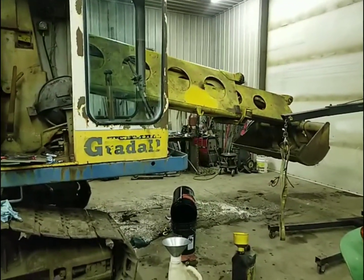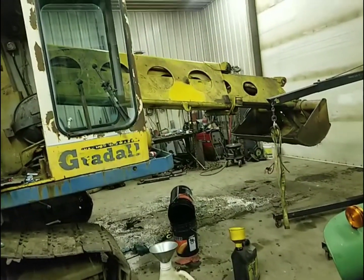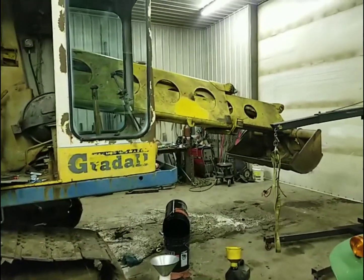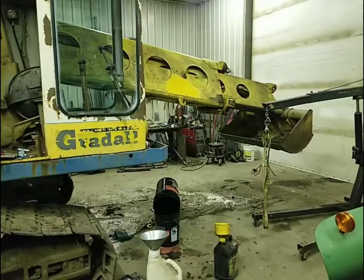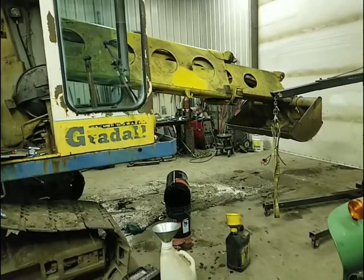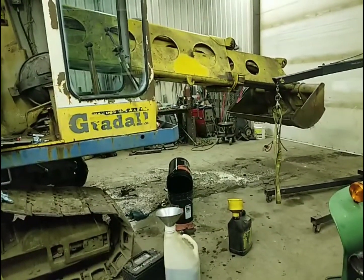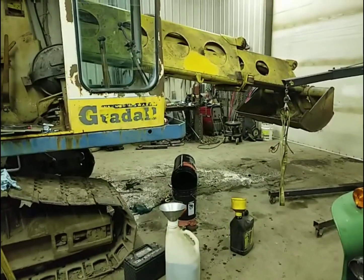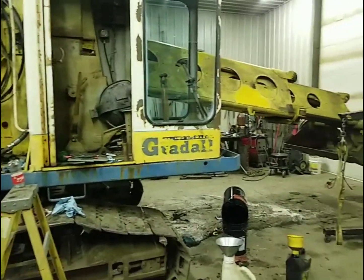I Soft Scrubbed the cylinders I mentioned earlier and took them up to Miller Hydraulics in South Bend. I didn't realize my buddy that works there hasn't retired yet, so it worked out great. He's going to find the right seals. I was going to reseal them myself - no problem - but the rams had some pits, especially the inner ram toward the cab, and I have no way of fixing pits. They welded a gouged blade cylinder on an old D65E Komatsu dozer with stainless steel, buffed it all back out, and never had a problem. He's going to do the same for me.